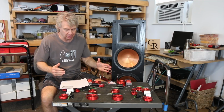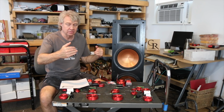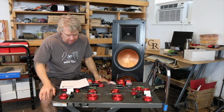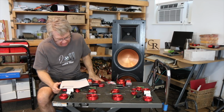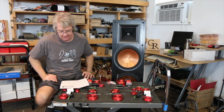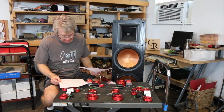So, on-axis frequency response, again, really smooth. And as you look at the horizontal off-axis response, you're on the tweeter axis and you're moving further away. And I did, by the way, design all this at 54 inches, which is a little further away, not just 1 meter. You have to move into 1 meter to see what its factory rated SPL curves are and all that. But to design a crossover, you want to get a little further away when you're doing a big speaker and the acoustic centers are farther apart. So this was designed a little further away. So the sensitivities that you see on here may be a lot lower than what the actual speaker sensitivity is. It probably falls in somewhere around 92 dB when I was through with this thing, and the way it was from the factory, it was a little above 95.